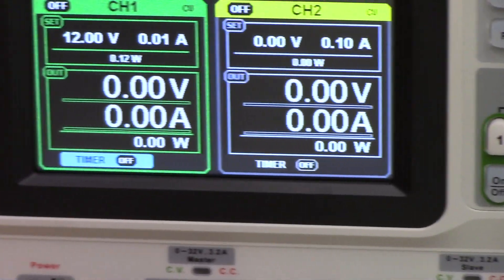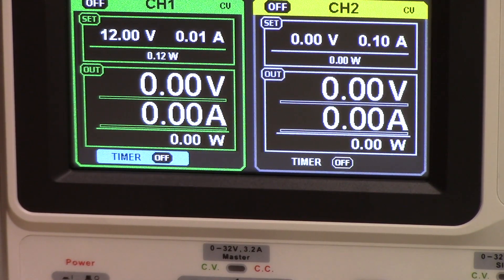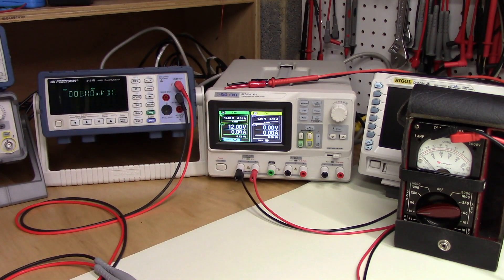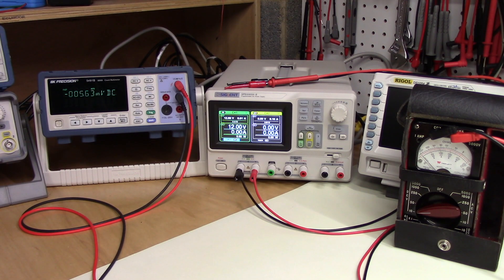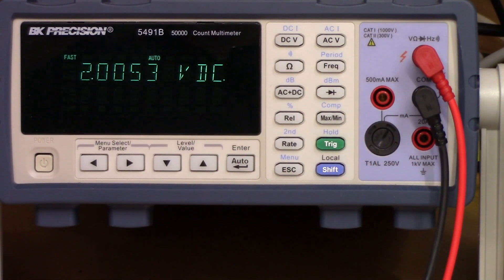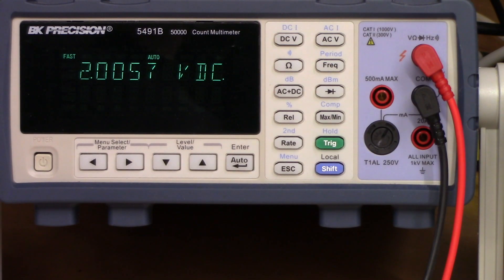You can see I'm feeding it with 12 volts and restricting the current to be no more than 10 milliamps, so that's about 0.12 watts being delivered to the circuit, which shouldn't give any problem to the quarter or half watt resistors. First, I'm going to turn the voltage on and probe with the bench DMM, which is a BK Precision bench meter. Remember we said that working out the voltage divider math, it should drop 2 volts across that 2 kiloohm resistor. With the 11 megaohm input impedance voltmeter, we measure 2.0 volts.